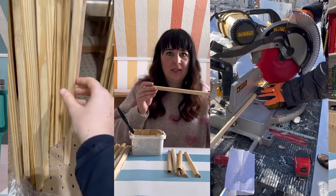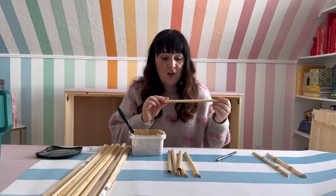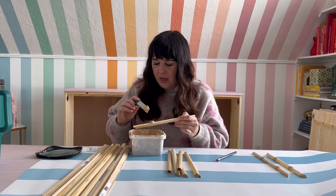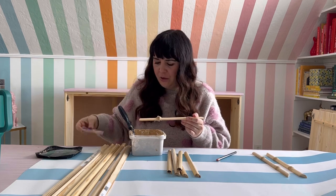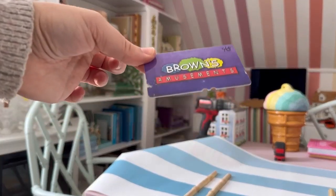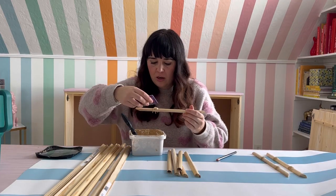The thing I'm most excited about is adding bamboo trim to the doors. I'm making it myself because buying it is pretty expensive. I have half-round pieces of wood and I've marked with a pencil where I want the bamboo detailing. I apply wood filler — which you can get at the hardware store — with a spatula, putting it on nice and thick. Then I use a stiff card, about credit-card thickness, and my husband drilled two tiny divots in the spot where needed using a drill.